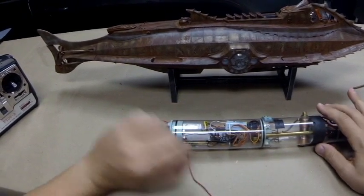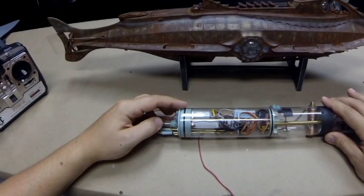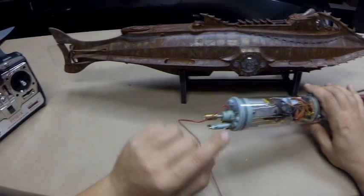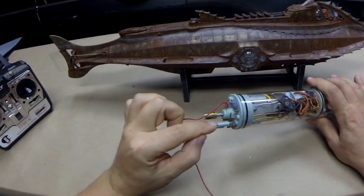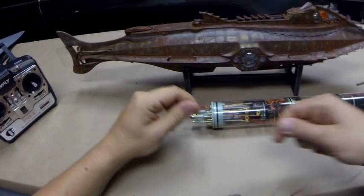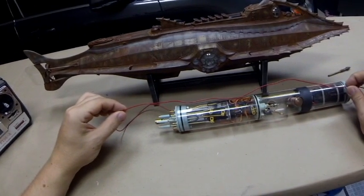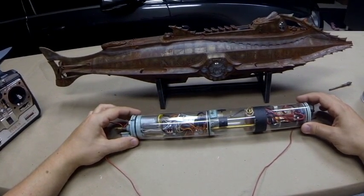This is an auxiliary power switch — you can see it can be actuated through this little sealed arm; it's in place and ready to go. Main drive motor. In the back you can see our seals in place, our magnetic linkages, and our main drive motor right here. This is the antenna for the radio system — it runs outside the cylinder and, as you'll see in a minute, it gets run along the inside of the hull. So that's the main drive unit, the expensive part of the cylinder.